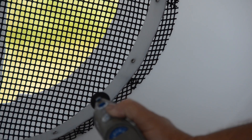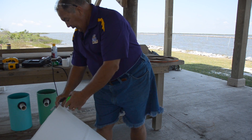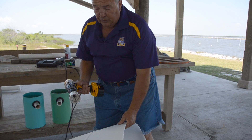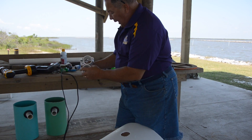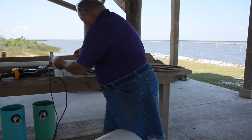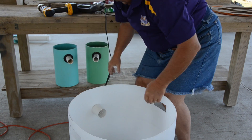The last cut to make on the silo is to put in a drain so the seawater can flow out over the seed. We're going to do this perpendicular to the axis of the handle, making a mark six inches down from the top. This uses a two-and-a-half-inch hole saw to accommodate a two-inch PVC pipe. I have a two-inch-long piece of two-inch pipe and two two-inch couplings. I'll glue all this together and sandwich the couplings on the inside and outside. Give it a good twist — and that's your drain.